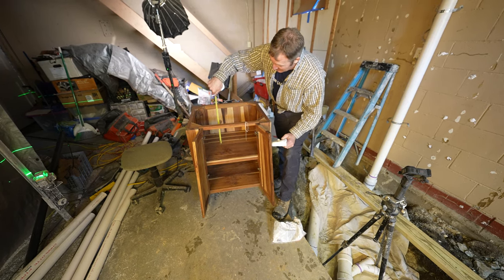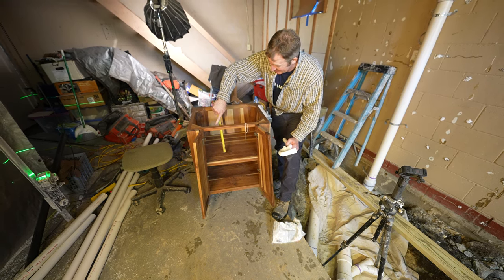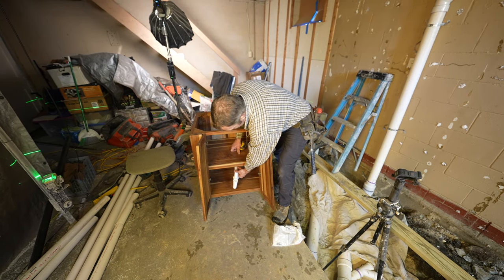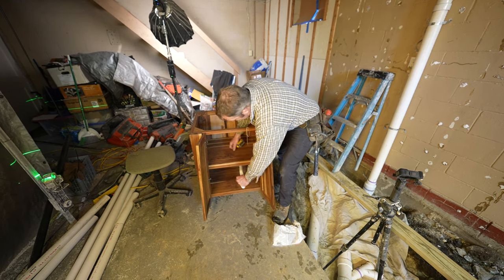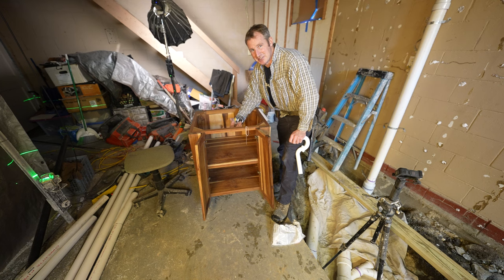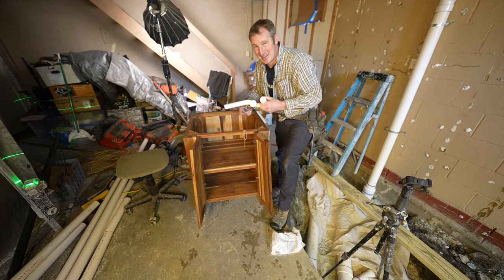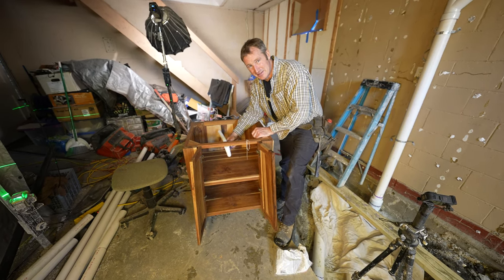So looking at this particular model, we have less than 12 or 12 and a half inches from the top of my vanity to the shelf. So with an undermount sink, you're gonna have to have the trap come down below and then basically cut a hole in this shelf for that main extension to go down into this. Because most of the time undermount sinks are about 7 inches deep, and then you have your drain assembly. And so by the time, even if I put this straight on top of this shelf, I'm only 8 inches. It's too close to chance. Like I said, I don't want to make some kind of ugly hole for this to attach to correctly.